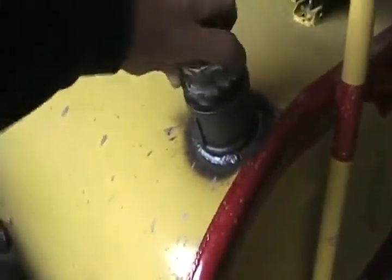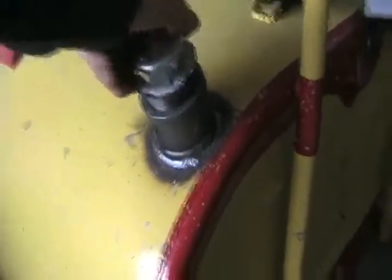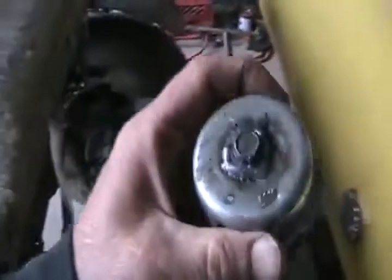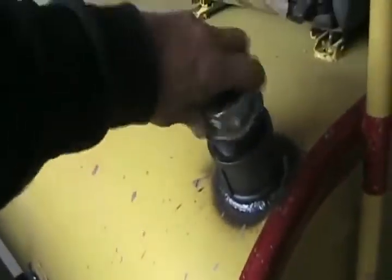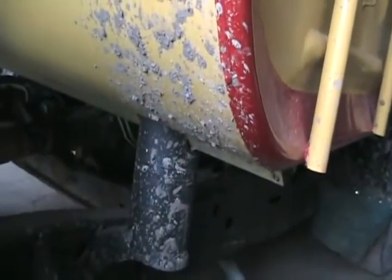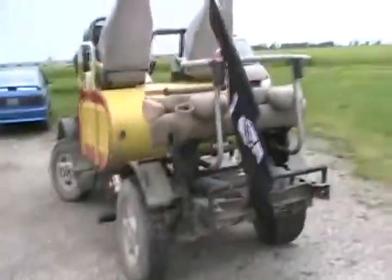I've already made the water cap. It's really hard to find caps anymore that you screw onto plumbing fixtures like thick pipe — people must make bombs out of them. So I had to use a lawnmower cup, like a Tecumseh starter cup, to make a cap so you can get some grip on it when you're using it. I've welded up all the holes on the tank and now I'm just ready to weld the two spigots on to attach those ball valves.